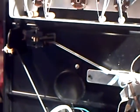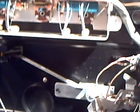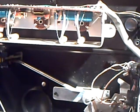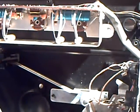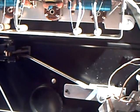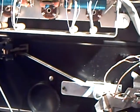And then it ends up there's no sound. So having got sound on the left channel, I tried tapping to no avail. Sometimes if you tap them gently with a screwdriver, having ascertained which bank it is, you can get them to come back. They sometimes crackle and moan a bit, but they do come back. But this one wouldn't until I took it out of its clip here, and then all of a sudden we had sound on both sides. So then I could tap it a bit more, and as you see, it's back in its clip now, because it really ought to live there.